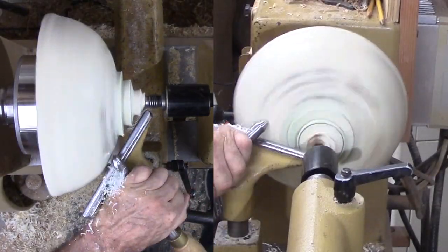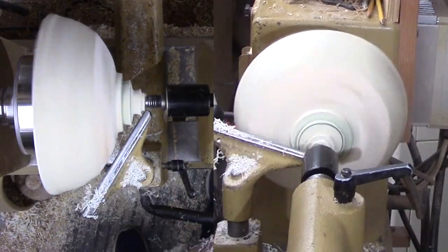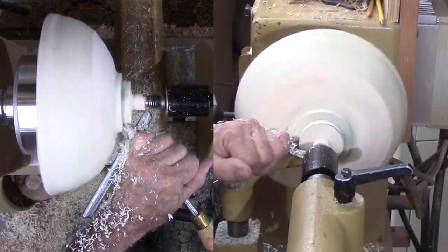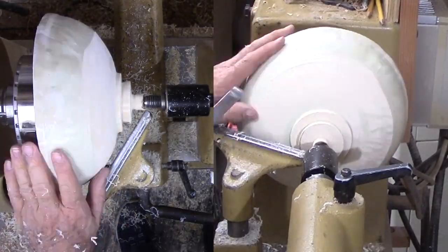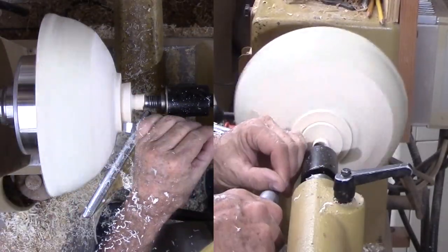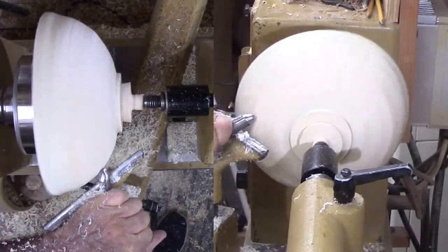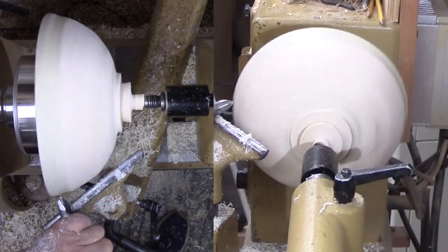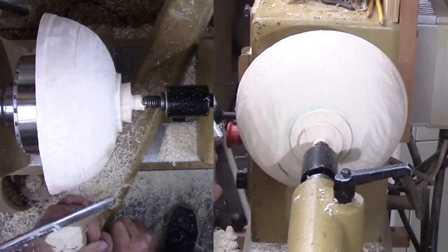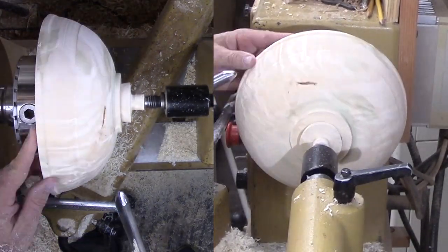Now I have pressed the wood against a closed chuck with live center mark. The difference this time is that the closed chuck is mostly inside the concave bowl. The original live center mark has survived. I try hard to keep that mark or reproduce it while still green and still mounted to the lathe. After drying, it is the best center indicator available. The objective is to re-cut the tenon then do some shaping to remove the sealer.